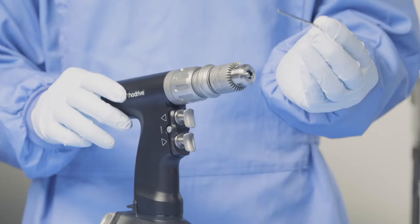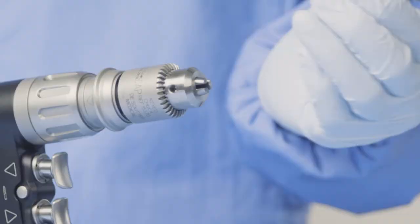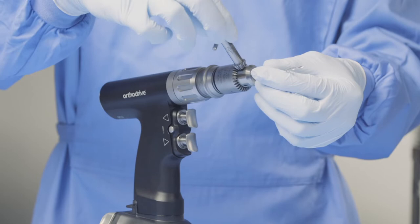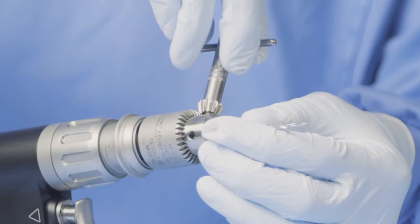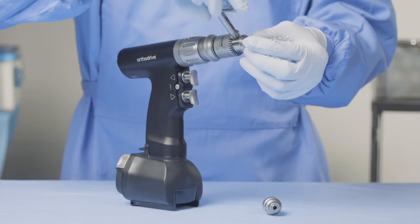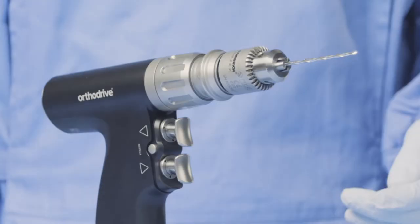To lock this drill bit into place, simply slide it into the teeth of the Jacob's chuck and then take an appropriate chuck key, insert into one of the three holes and turn in a clockwise direction to tighten. Once tight, give it a little extra turn to hold it in place and then you're ready to go. Take the tool off safe mode